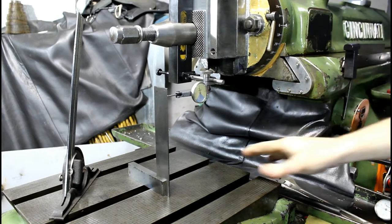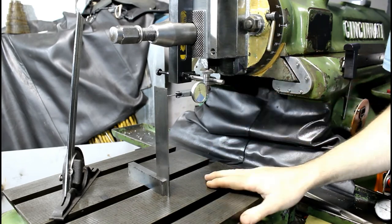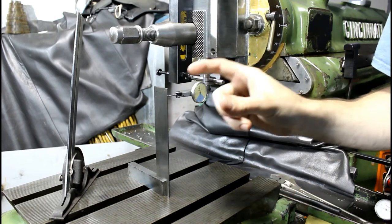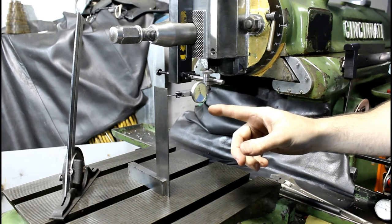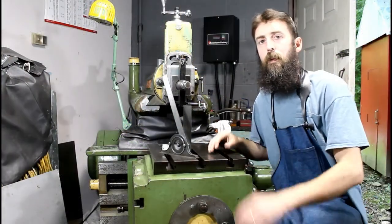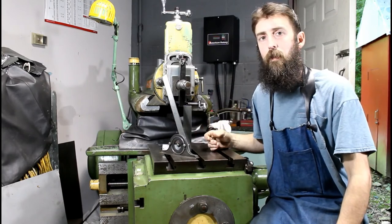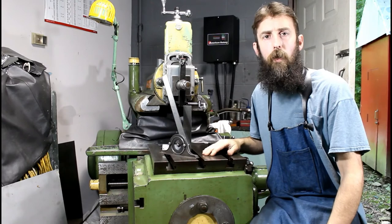So that's the way I set up the compound. If I wanted to do it at a precision angle, I would use precision equipment to gauge it from. The precision ground angles are really nice — I don't own any, but if I wanted a precision ten degree angle, I would use a precision ten degree angle off the table with a dial or test indicator and run it along that until I had a zero reading. Alright, we've got our table within reason right to left and front to back. We've got our compound squared up. If we were going to be working off the table, we're good to go — bolt our work to the table and do the operation that we need.